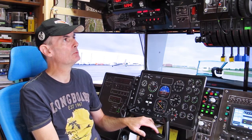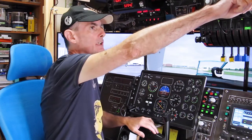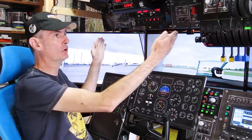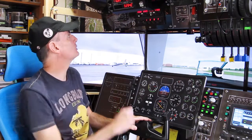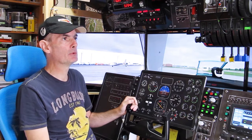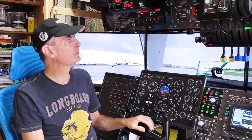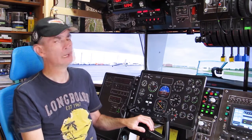Basically — I'll show you this in close-up in a minute — the structure that needs to be moved is supported at four points: one here, one here, and two at the back. There are two horizontal spars on which everything up here is supported. All I need to do in principle is support those, remove the four bolts, jack those two spars up by 10cm, and reattach them. So I'll show you this in a bit of close-up and then we'll crack on.